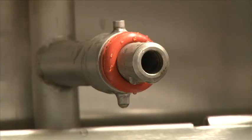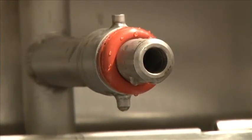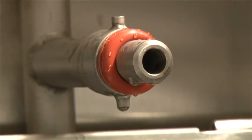This arm must be cleaned after each meal period because it recirculates the water from the final rinse and can get debris stuck in the nozzles. Before replacing the dual rinse arm, there should be 2 orange O-rings at the end of the pipe fitting, a round O-ring and a square-cornered O-ring. The square corner goes on first and the rounded edge goes on second.